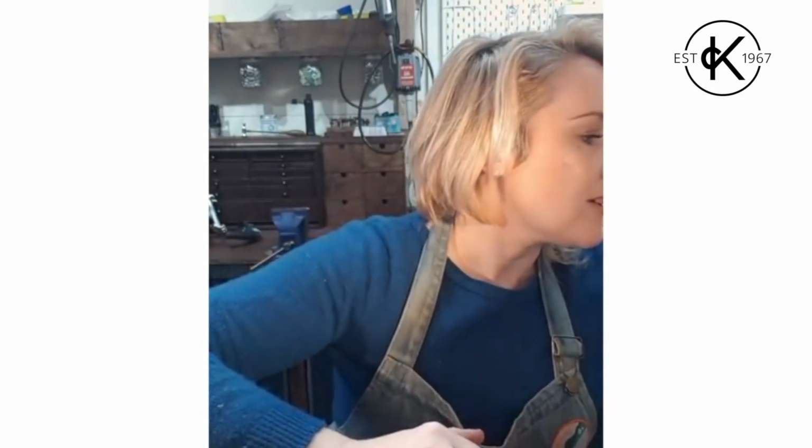So a quick bit of health and safety. The first thing is, if you're cutting anything out, there's always the chance that it's going to ping around the room. So although most people don't wear eye protection when they're cutting sheet metal, obviously it's always going to be safer if you've got something over your eyes. A good pair of wraparound goggles are the preference, or when you're doing lower risk activities like this, but you just want to have a little bit of protection, and you wear glasses, it's sometimes good to pop those on, because then at least you've got something just in case a little bit of metal goes pinging around the room.